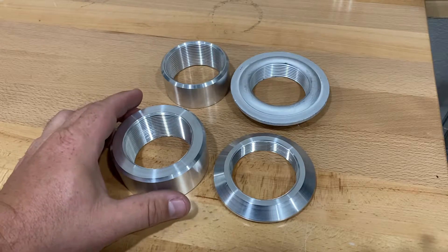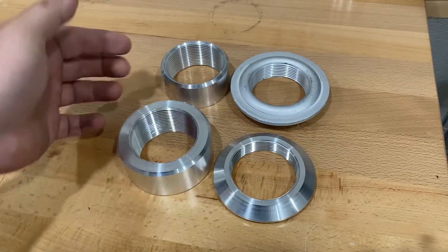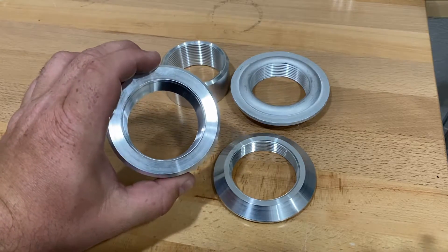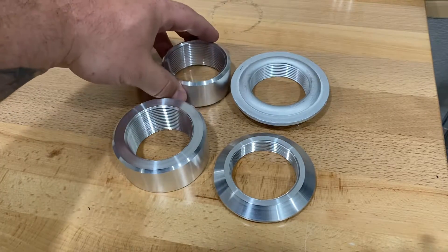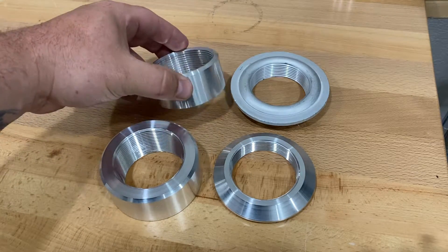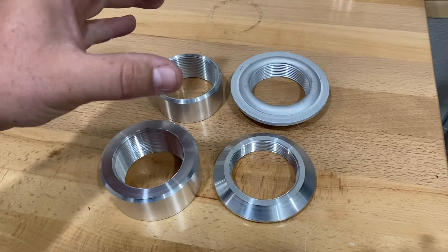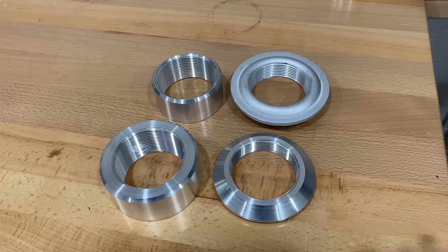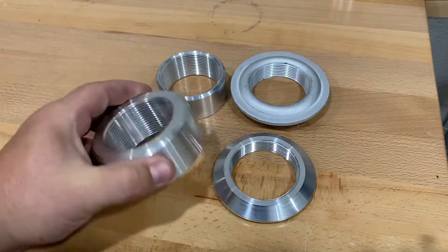We also make a two-inch half coupling version we call heavy wall. Same two-inch NPT ID, but we've substantially increased the OD so you have almost a half-inch thick wall. That's mainly to resist distortion — even when welding, if it's slightly crooked, it's possible to distort the fitting so it doesn't thread perfectly. This is especially relevant in aluminum, which can move around a lot when introduced to heat.